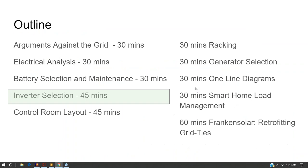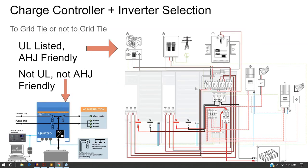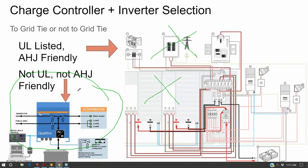Okay, so moving on, we kind of talked about the nuances. There's a huge cost difference between stackable inverters that you can just keep adding more for power that are also rated to be grid connected and backflowing, versus getting all-in-one units that are cheaper because they're not designed for the grid connection. They're not designed to be stackable. They're only designed to be one way.